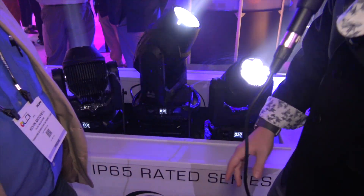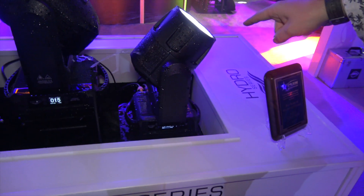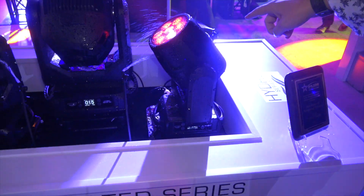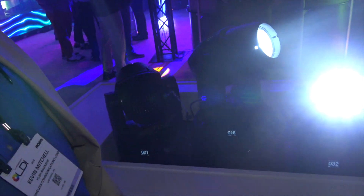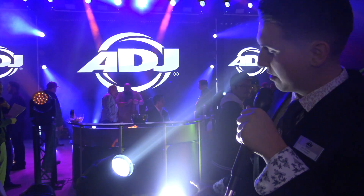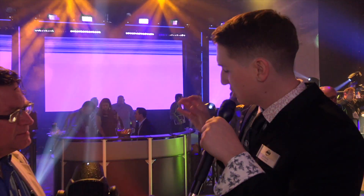Now we're talking about washes — let's step over here to our new Hydrowash X7. This is again fully IP65. This is our little brother to a new light we just came out with. It has 7×40 watt OSRAM LEDs, they're going to be RGBW, and they're actually fully pixel mappable so you have full control of every single LED. It has 5-pin DMX with locking IP65 power ins and outs as well. There's a zoom range from around 10 to 45 degrees, so this is going to be for small to medium-to-large size stages with tight beams and nice washes.